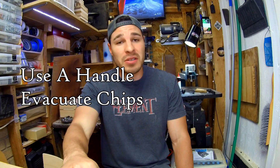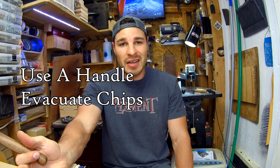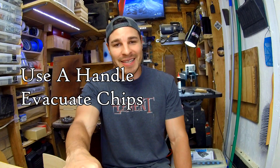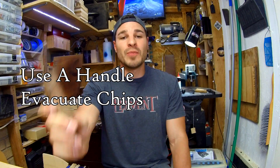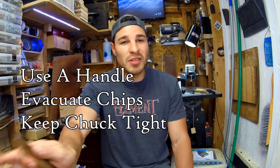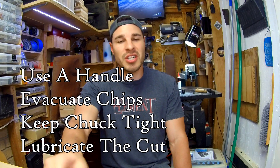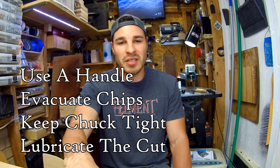This is just a carbon steel tap — nothing special, just from a Harbor Freight set — and so was the other one I broke that I can't get out of there; I'm just going to have to lop it off. The other piece of advice I'd give you is make sure that you have cranked down on your chuck. Also keep your tap well oiled — it makes a huge difference as far as clearing the chips and giving a little lubrication to the cut.